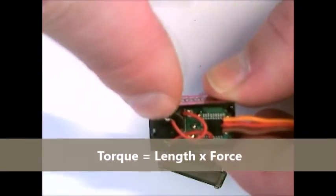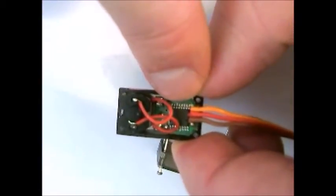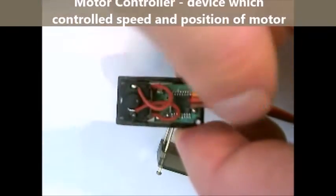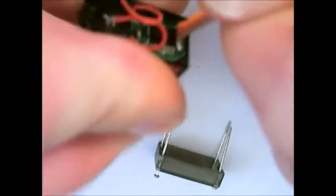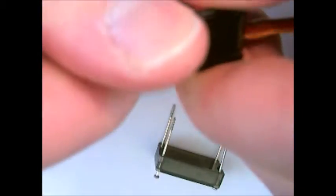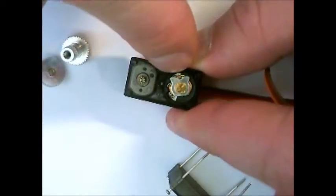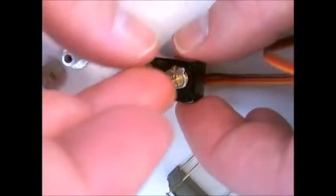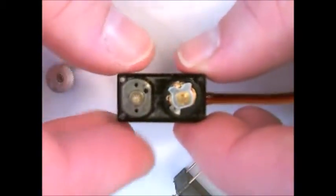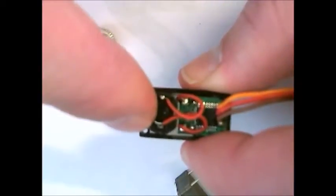Under here you can see the chip. The motor is connected directly to the chip, and you have the ground, power, and PWM wire coming in here. This chip is what's called a motor controller — it takes the PWM signal and converts it into a set of pulses that control the speed and angle of the motor. This rod goes down into what's called a potentiometer, which is basically a resistor angle sensor. As the gears turn, it spins this potentiometer to show what angle the servo is at. When that potentiometer measures the angle, it tells the chip, and the chip turns off the motor so it doesn't keep spinning.